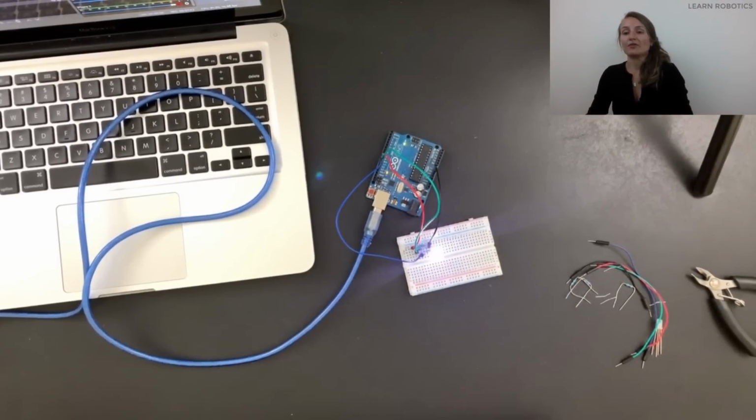And I did want to point out that there is something interesting about this project. If you do set up the colors and you use a color picker, what you're getting is a proportional percentage of the color. The closer to 255, the closer you're at 100% brightness. So if you set it to 127, you're going to be at 50% brightness. It's going to make the color less bright, a duller version of that color. But that combined with other colors gives you that variance in shades. So it's not going to be perfect.